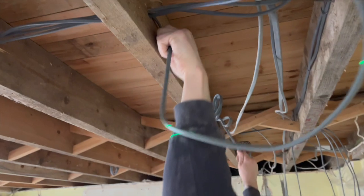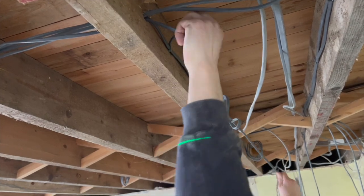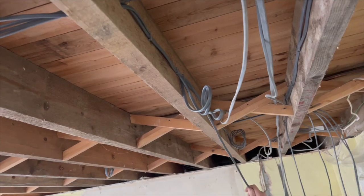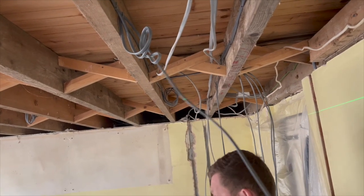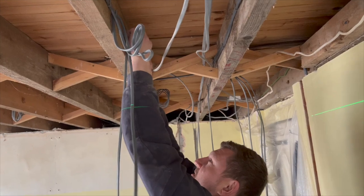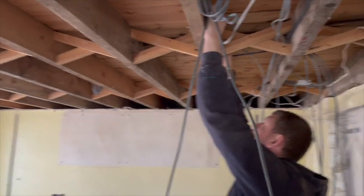I'm pushing this through because it's very easy to get an extra cable through these things - if you've got a 1.5mm going through the staples it's just so much easier. Otherwise you end up with staples everywhere and it fills up the whole place and it's a nightmare. Save on the staples. This isn't archaic but some of it is old stuff - see there's 6mm cable, all the site temporaries we're using just to keep them going.